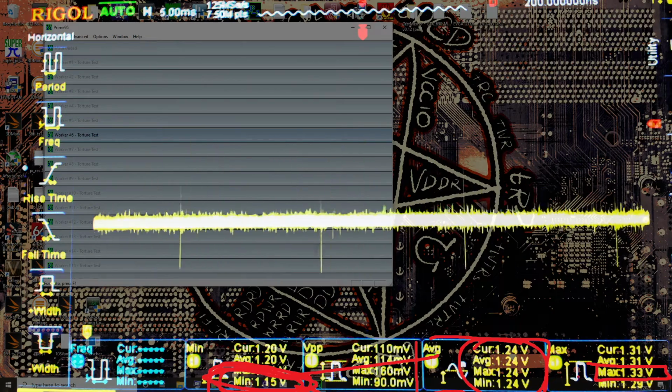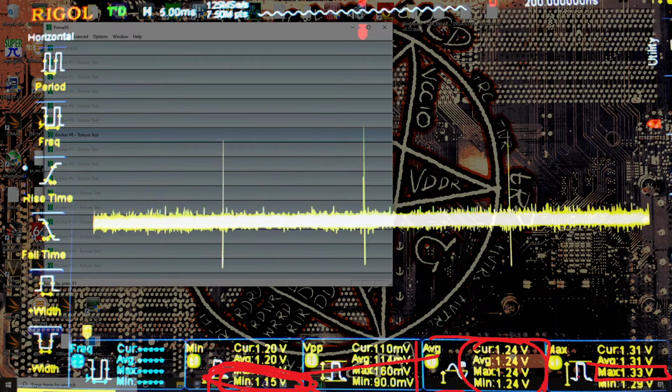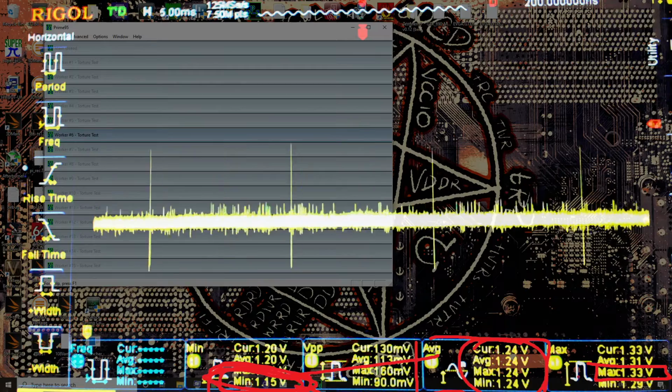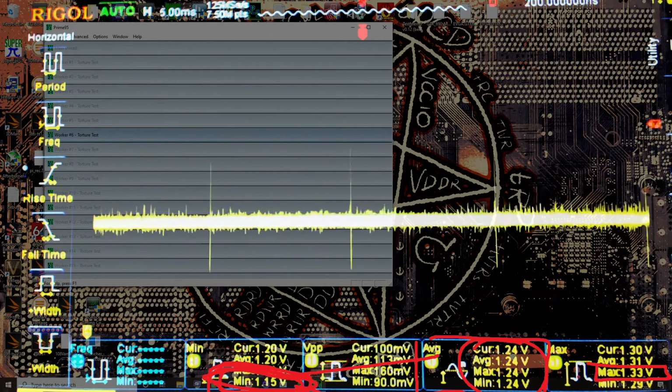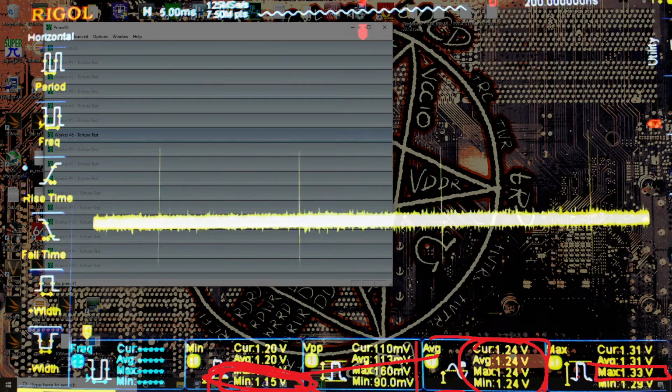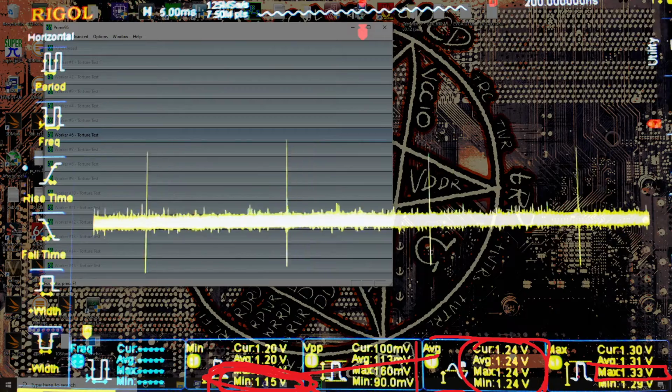If the CPU was at 1.4 volts, that would still be under 1.5. Also, if you were running the CPU in Prime 95 small FFTs with 1.4 volts, it would be completely uncoolable. So good luck with that. I think you'd actually kill the CPU from thermal damage rather than overshoot.